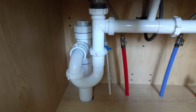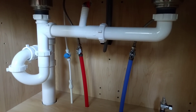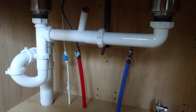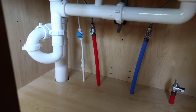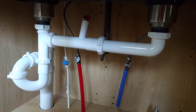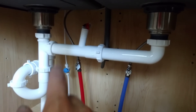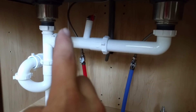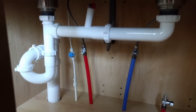So what we have here is a two-inch drain line coming up through the cabinet base. Depending on where you are, codes vary a lot on how they want you to do this. There are a couple different methods. One is to oversize the drain line until it can get to where it's vented, or to create a venting system in your island — you would bring your vent up from where it is, then over and back down again in the cabinet with clean-outs in that pipe, and then it would go down below the floor and tie into a vent line.